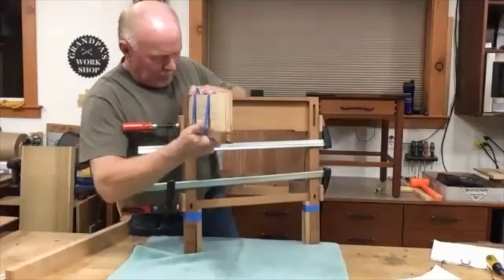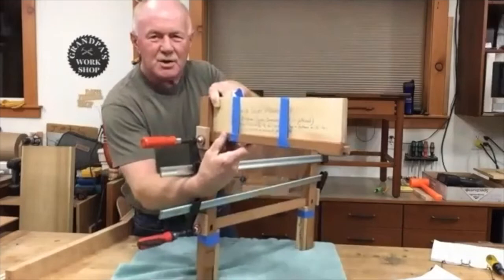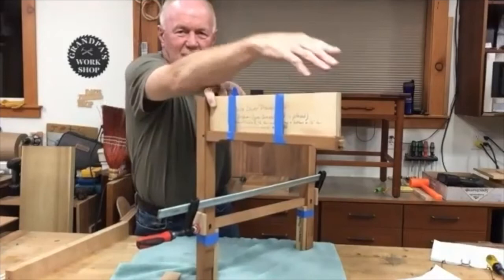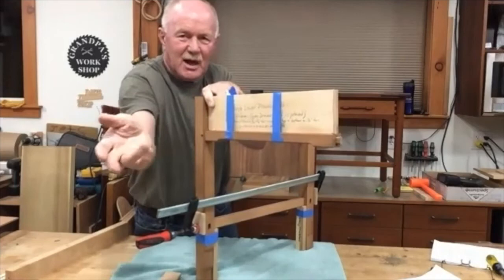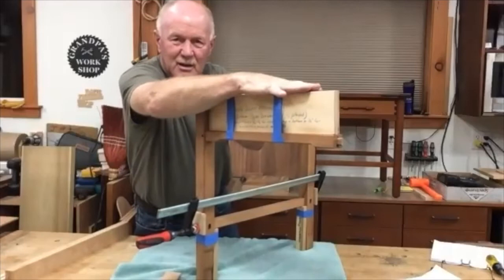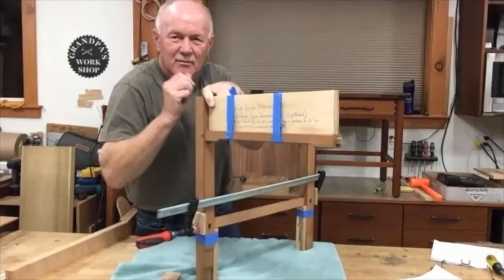So again, I'll position this piece at the bottom of the mortise, get them put into place, put the caul across the top, use the clamp on one end and on the other, and it'll pull it right up there snug. When I pull this piece out, take my 3-inch drawer, it'll have a perfect 16th inch reveal below and on top, and this rail will be parallel with the top rail and parallel with both edges on the drawer. You see that happening?